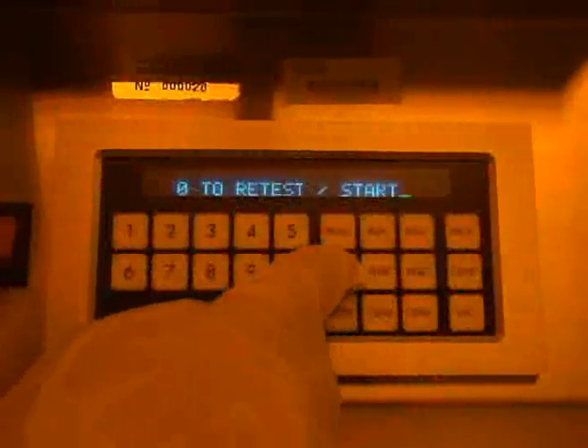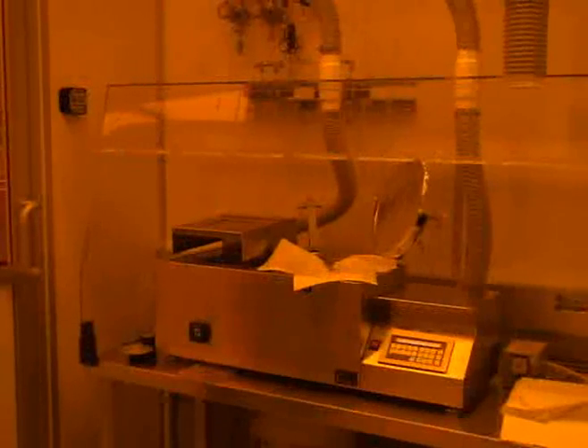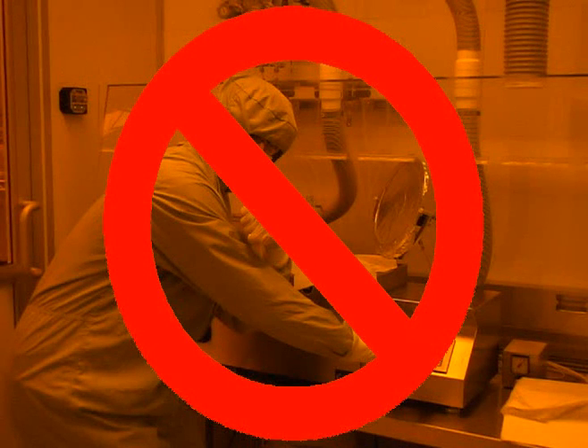You must also lower the hinge panel for the fume hood. The spinner will not start unless you have done so. Once you have done this, you may press the start button. The spinner will then run through all the steps you have set in the program. Do not start the program if the spinner lid is still open — photoresist will most likely be sprayed over the work area. In addition to photoresist having toxic vapors, it is also very carcinogenic.